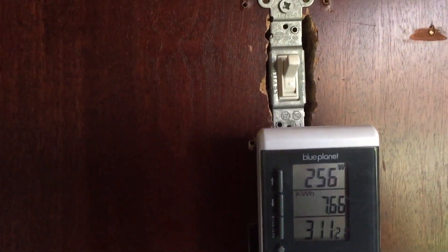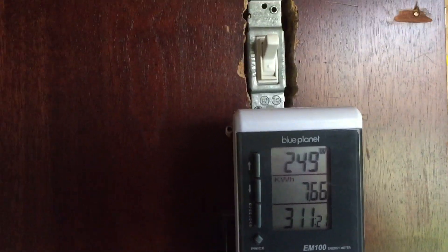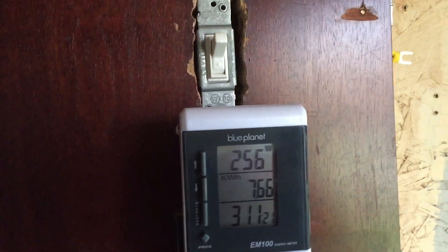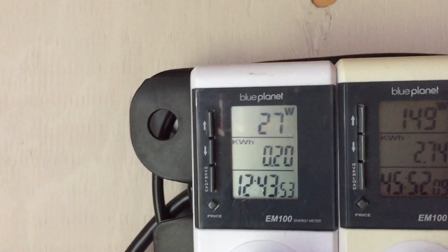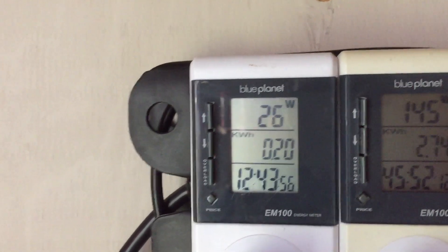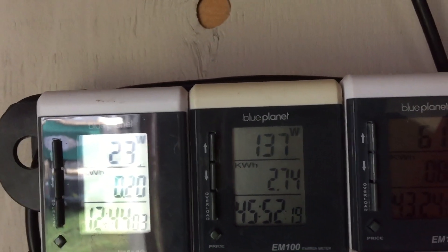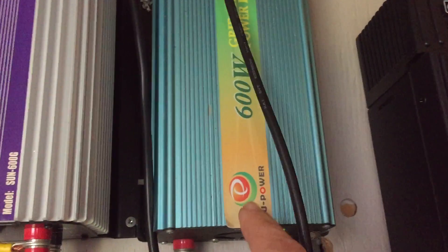Right now the total is 254 watts going into the house and 249 — not too bad. My house idling with everything off takes about 170 watts, so on a sunny day this will creep up to about 600 which is more than enough to cover most things. This one here is only putting out 27 watts because it's a kind of crappy day — that's the 265-watt panel on the post. The center unit is actually two Sharp panels facing south.